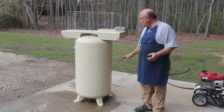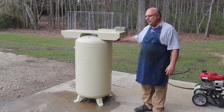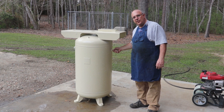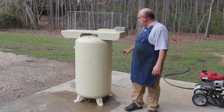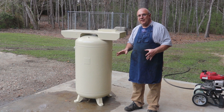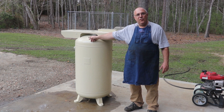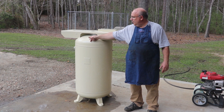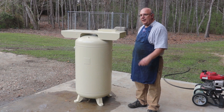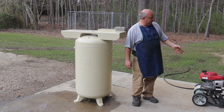What I've already done is fill the tank up to a certain point with water. We're going to fill it the rest of the way in just a minute. I'm coming in on a spout on the top, putting the pressure on the side, and putting a gauge up on top. I'll fill the rest from the side — I don't want to have any air in the tank, so we'll fill the water up from the side until it's just running over. I'm going to cap it off, put a pressure gauge in, and then pressurize. I'm going to be using a pressure washer. Need to be careful, though.